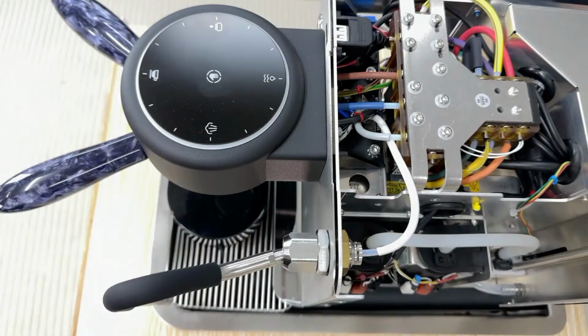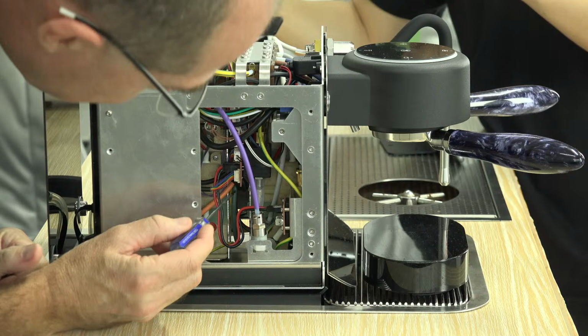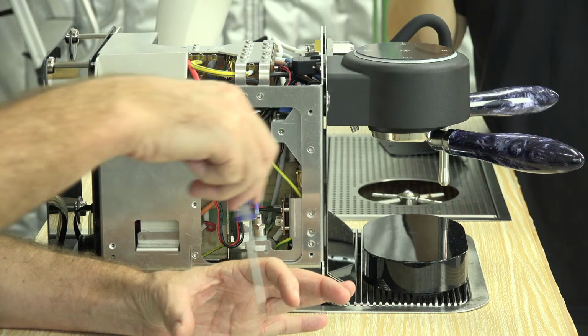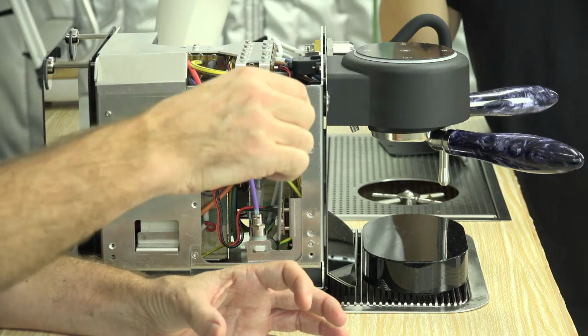Coming back over here, let's switch over to this camera. In here, you can just make out that there's two heaters. Now, the heaters are our own design. They have a stainless steel tube that coils for 2 meters. And then mixed in with that stainless steel tube is a heating element that is right next to it, again, for 2 meters. That whole thing is then encased in aluminum. And then that has a temperature sensor and 2 thermal safeties on it. And those are the 2 heaters we have.